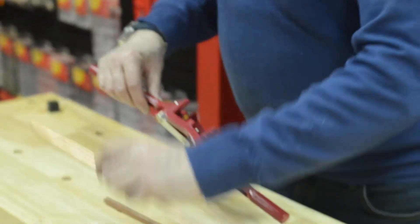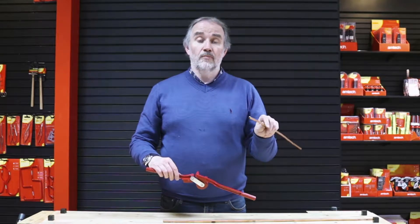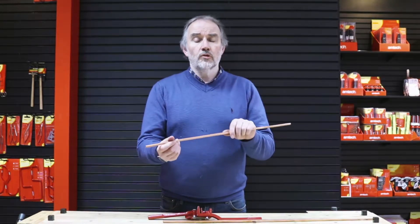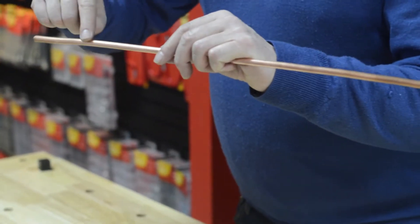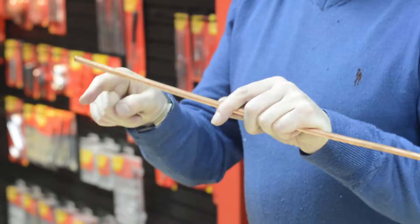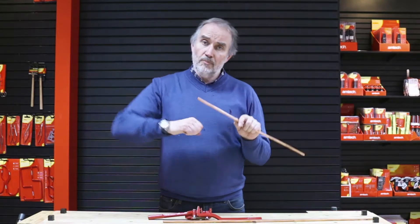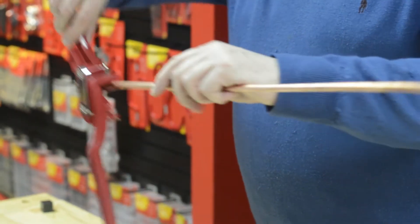I'll go with the 8mm first, because I've actually bent some of this - I've got it in my own house on the downstairs radiators. It is copper tube; you need to make sure it's quite bright coloured. If it's old copper tube it's probably aged and gets a lot harder to bend, because you've got to stretch the outside of the copper whilst underneath you're shrinking it. It's not unrealistic that you'll get little tiny bend puckers on the inside, but with a bit of practice you should get good results.